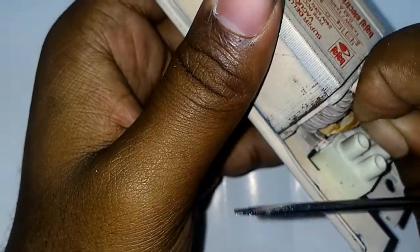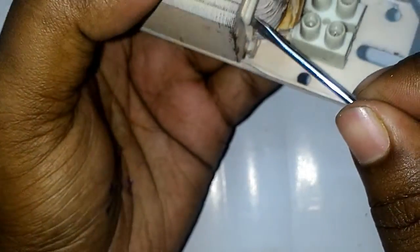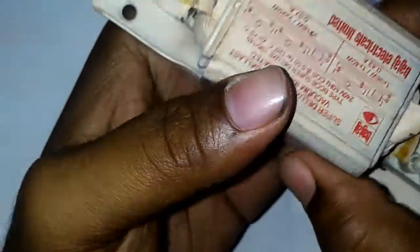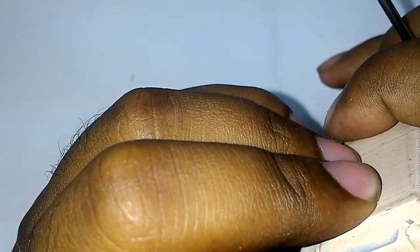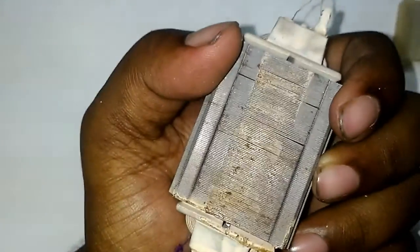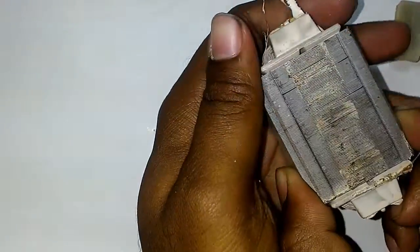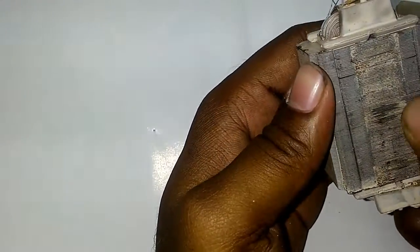You can see it here. So an electrical or magnetic ballast or choke is nothing but an inductor — copper wire wound in an iron core. I will break it a little more and you can see on this side also there is iron core present.